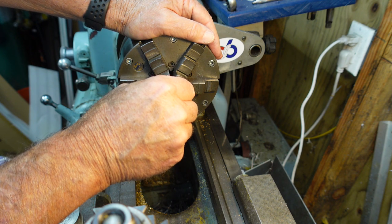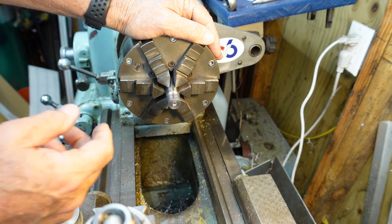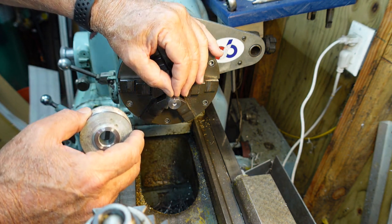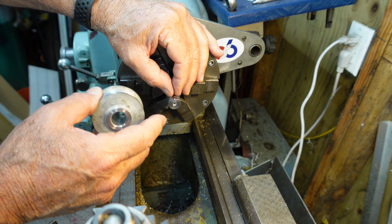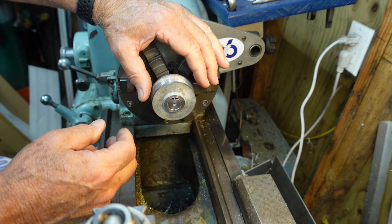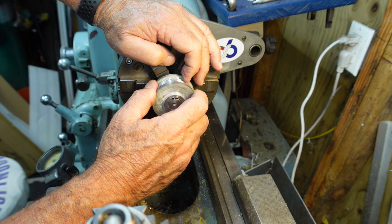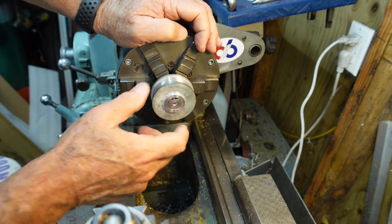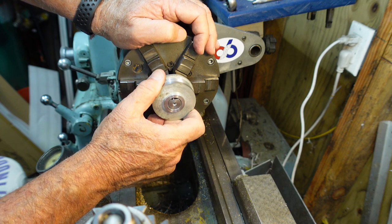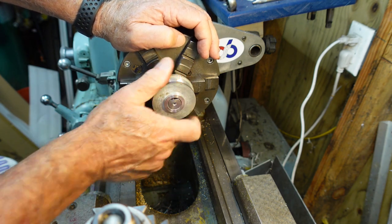The pin can't be taller than the bore — it has to fit within the bore. But once the unit slides on, you can see the pin, and when it locks the pin has moved over center — that's what causes the lock. When you release, the pin is free. So twelve-to-one ratio — give it a try, pretty simple to do, and it may get you out of a jam when you need to hold a part.